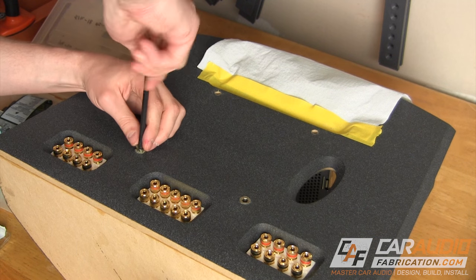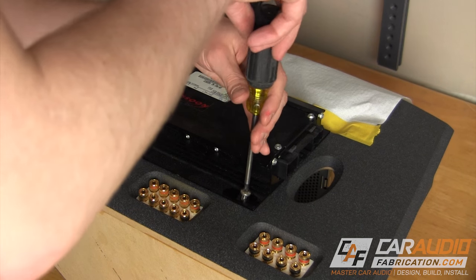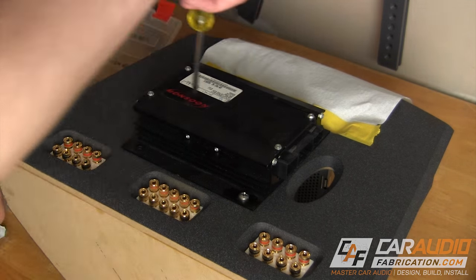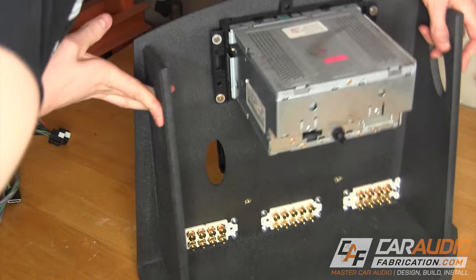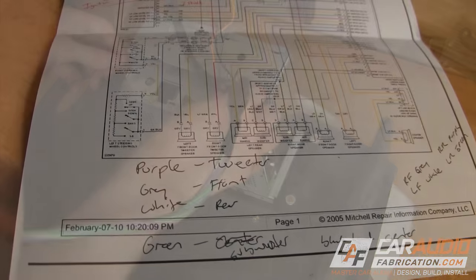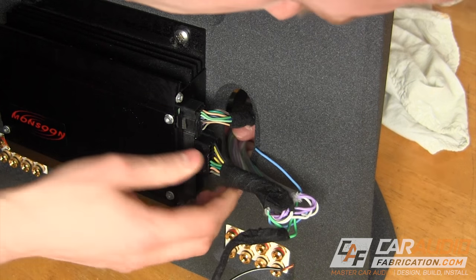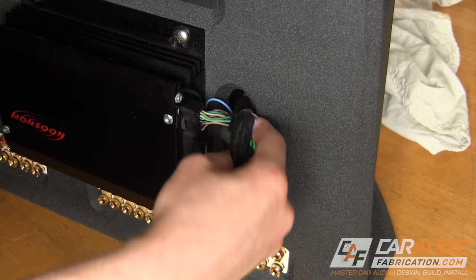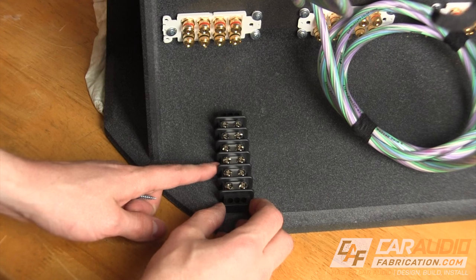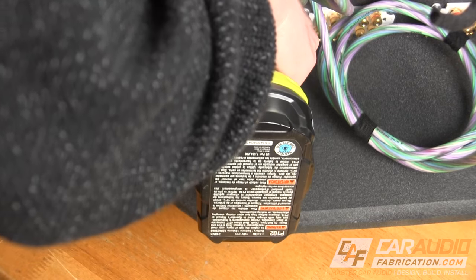Next, I have to mount the amplifier. For this, I'm using threaded wooden inserts, which add a metal thread to the wood so if I need to take the amplifier on and off, I can do so many times without compromising the hole drilled into the wood. To mount the radio, I simply applied screws from the back side of the panel. I used a wire schematic I found online to connect all of the important wires that attach the stock amplifier to the stock radio, using nine conductor wire. I also use the same nine conductor wire for all of the amplifier outputs that will run to the banana plug binding posts.